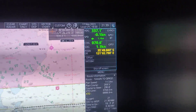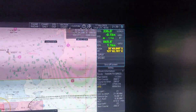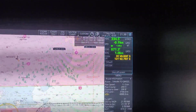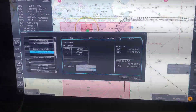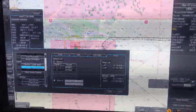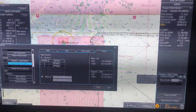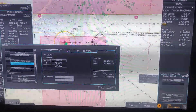As you notice, the position sensor has been changed to DR — dead reckoning — and the position color has changed to yellow. This is how we do it on Furuno ECDIS. I'm not sure about other ECDIS systems like JRC, Transas, or others, but this is how it's done on Furuno. If we are underway, we can run up our course and speed and get our position from there.